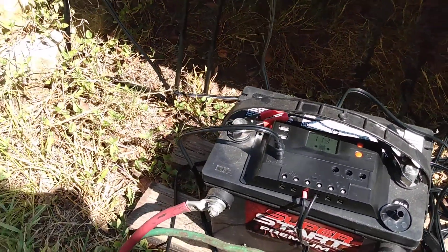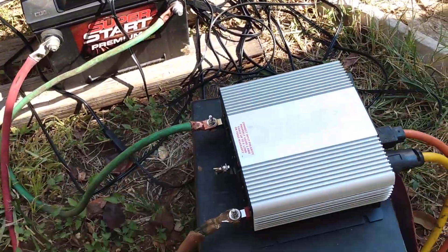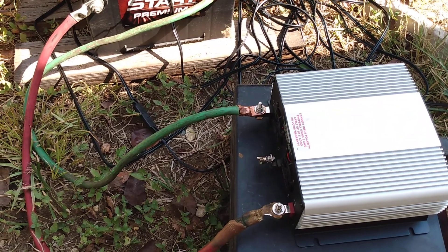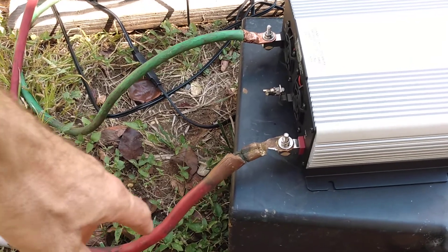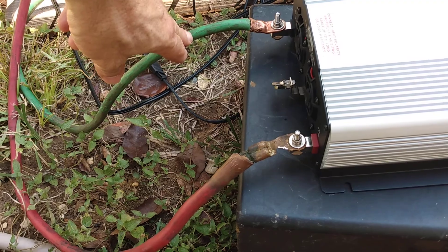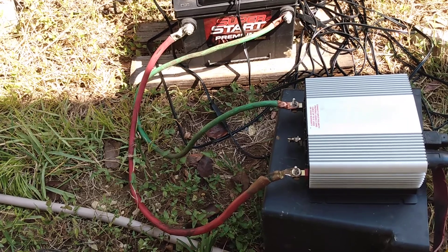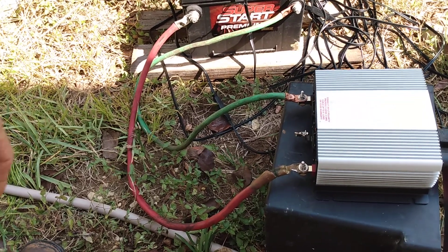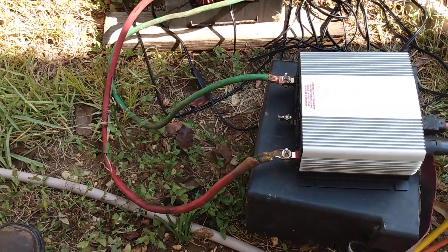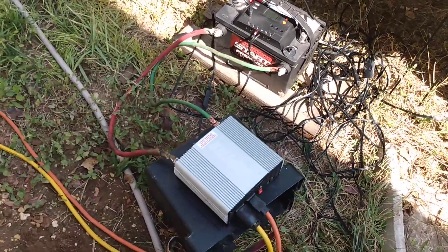The requirement for this inverter is supposed to be 2-0 gauge cable no longer than 6 feet. This cable is the only one I have near 2-0, and the other is obviously not. So I kept the cable run down to about 2.5 to 3 feet. I obviously also need to replace the end connector here — I had limited supplies and had no idea if parts stores even had electricity so they could sell me something.